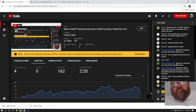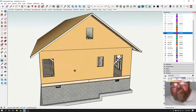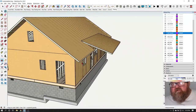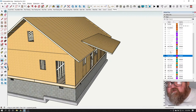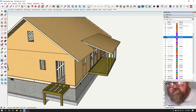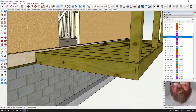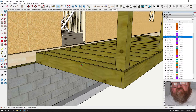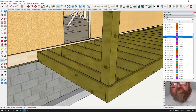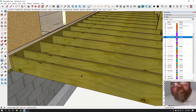A viewer asks: can you use all treated wood to build a home with cost not being a factor? I wouldn't, because treated wood is really kind of crappy, to be honest. I tolerate it for porch framing and things exposed to weather. The problem with treated lumber is it has a high moisture content, and as it dries, it twists, warps, cracks, and cups — everything bad that lumber does, treated lumber does exponentially, faster and guaranteed.